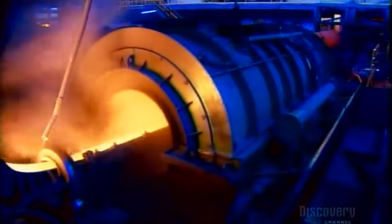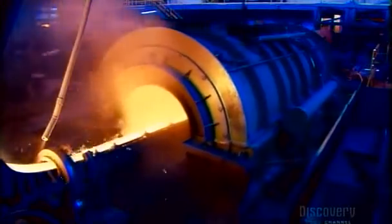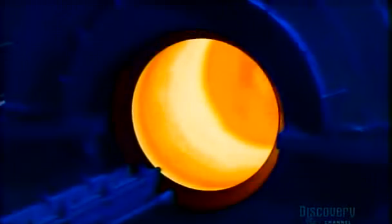The molten iron travels down a trough into a casting machine. It enters a spinning mold. Centrifugal force spreads the iron against the mold walls. A cooling system chills the walls, so the iron solidifies within seconds. Then an extractor pulls out a 6-meter cast iron pipe, the standard industry length.